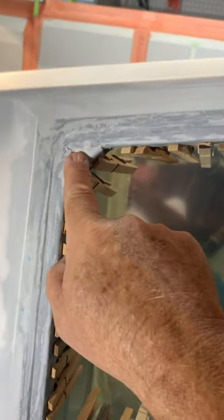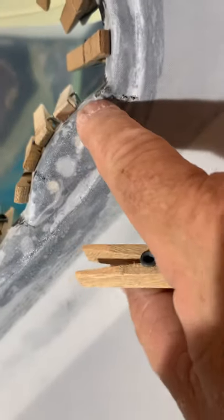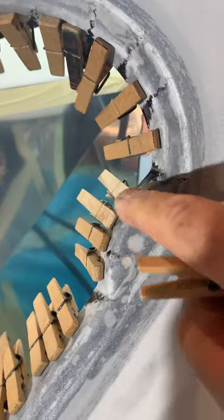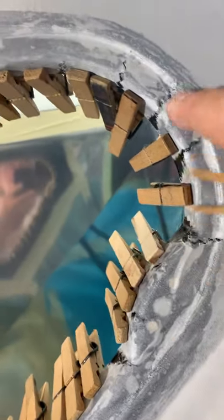We're going to cover these areas that we've spliced. You've got to cut these radiuses. You can see here I cut one, two, three pieces out of this — a cut here, a cut here, a cut here, and a cut here — so it would stay recessed and go around this radius. Same thing here, you can see the cuts I had to make to be sure that this stayed recessed while it glued down. Glue that part and then let it get nice and set up.